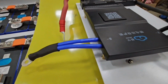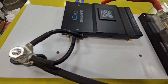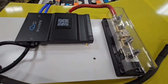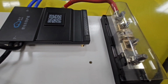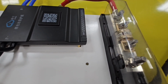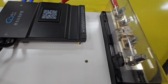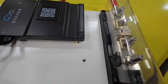But yeah, basically I made myself a template to make this plate, and being I had a couple of them to do, that's the way I did it. This is a 200 amp BMS, but I only have a 175 amp Class T fuse in it, and I'm not worried because I'm going to have 5 batteries on the bank here, and I'll be lucky at peak if I'm drawing, you know, 30 amps per battery or 40 amps per battery. So, you know, that's not going to be an issue here.